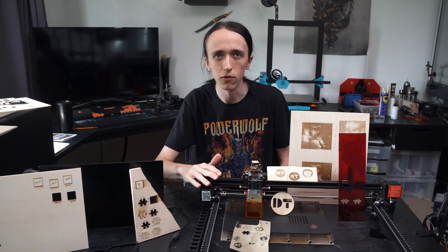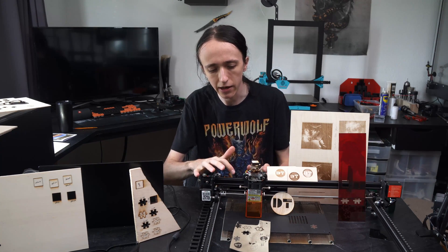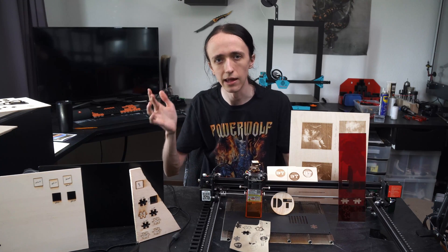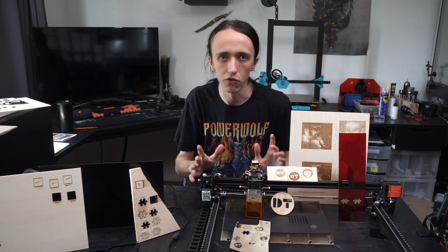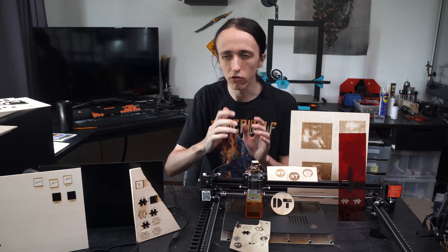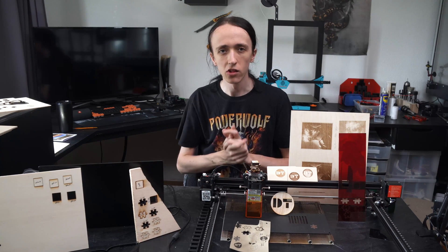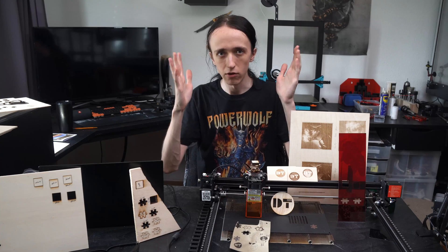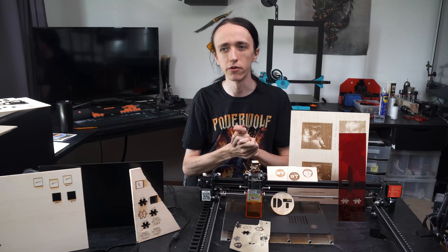This machine is a great starting point if you want something that's not just a toy but actually usable for real work. Some things I'd definitely add — and I'll probably cover in a separate video — this kind of machine needs an enclosure unless you're using it outside, as the smoke gets everywhere and is a health risk. That's a gripe about this category of machines in general. Also, that drag chain on the X-axis cable would be a nice addition. If you're doing more cutting than engraving, an air assist is also a really good add-on, and it's something you can add very easily. Make sure to subscribe so you don't miss any future modifications — leave a like if you enjoyed, and I'll read and respond to your comments down below. Thanks for watching and until next time!